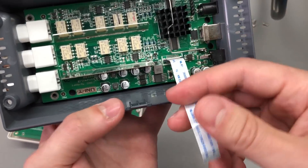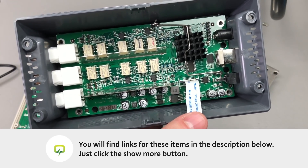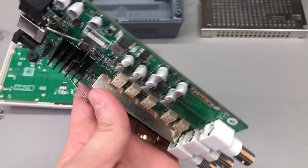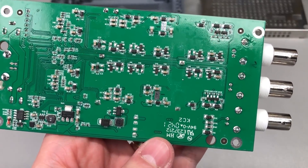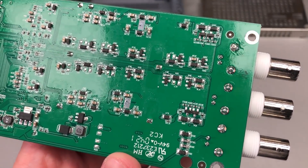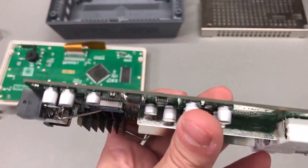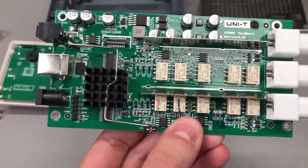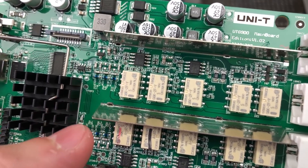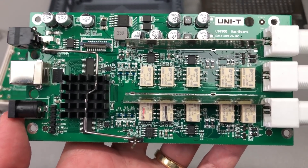After removing the shield we get a closer look at the analog board — I'll add high-resolution teardown photos to a blog post linked in the description. The PCB quality is good and the soldering job is superb. Judging by the flux residue they've done selective fluxing and automated soldering, which is not a cheap process, so they haven't cut corners on build quality. They seem to be using good quality parts: OMRON relays, TI-branded op-amps, and Analog Devices DACs — everything you could wish for, especially considering the cost of this instrument.